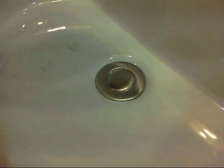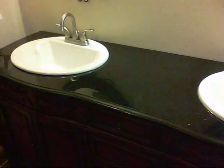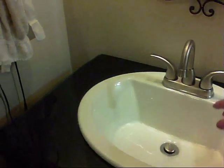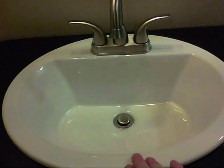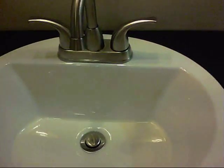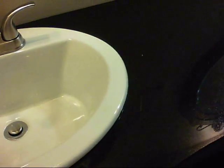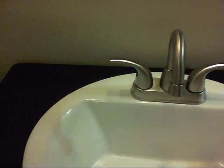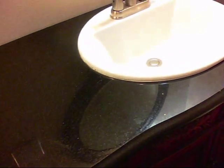With the drain removable, as I lift it up we can take it out. And that completes the installation of our new bathroom sinks. We bought some new faucets to go along with it — some really nice Kohler sinks and these are Peerless faucets. I was surprised how easy it was to cut the granite. One thing I learned is there's no way I would do that in my house, so if there's any way possible take your granite off and take it outside to cut it. You can cut it with just a simple eight dollar diamond grinding wheel from your local hardware store, and be sure to use water when cutting the granite to keep the dust down — it makes cutting faster and smoother.